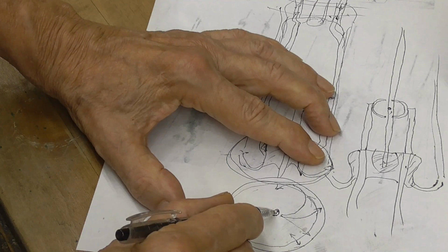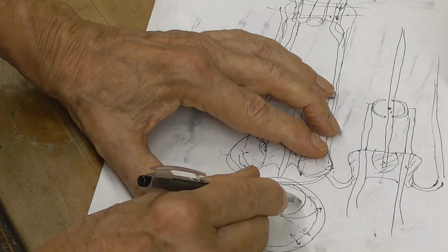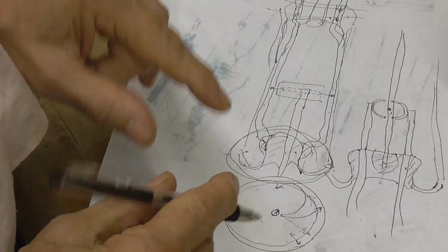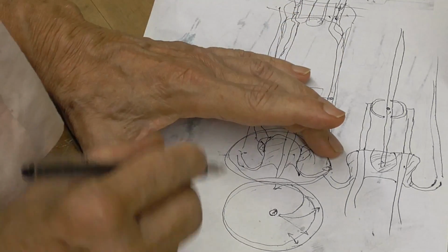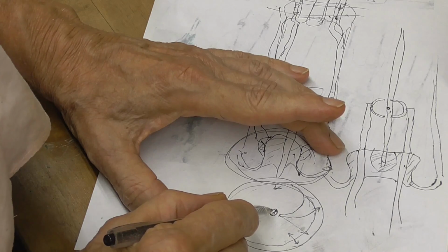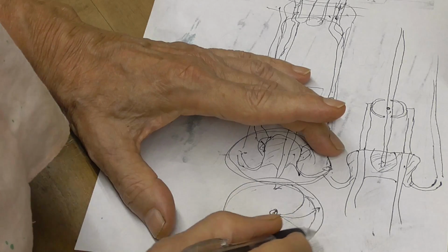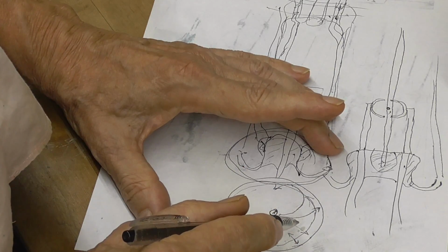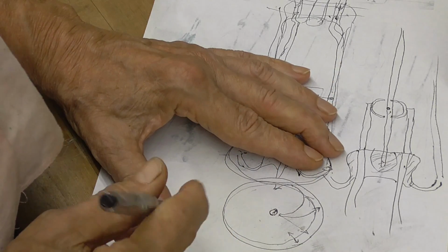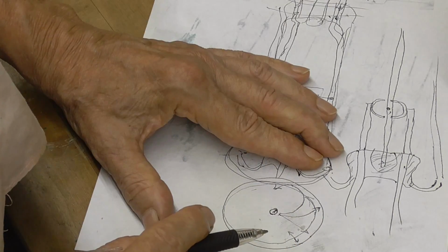And the strength of the magnetic field determines how much voltage it takes to get these electrons to curve. Now, on the other hand, the output power is determined by the current and the voltage. So if you have too low of a voltage, then you get very little current, so the total output power is low. So while it may be easier and take less magnet to go ahead and cause it to oscillate, the amount of output power will be much lower. It could be 10% or even 1% of what it is if you start really running the voltage up.